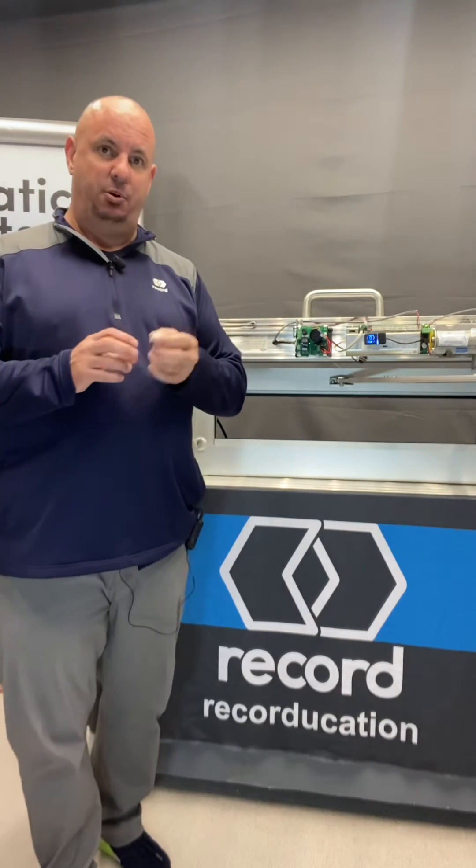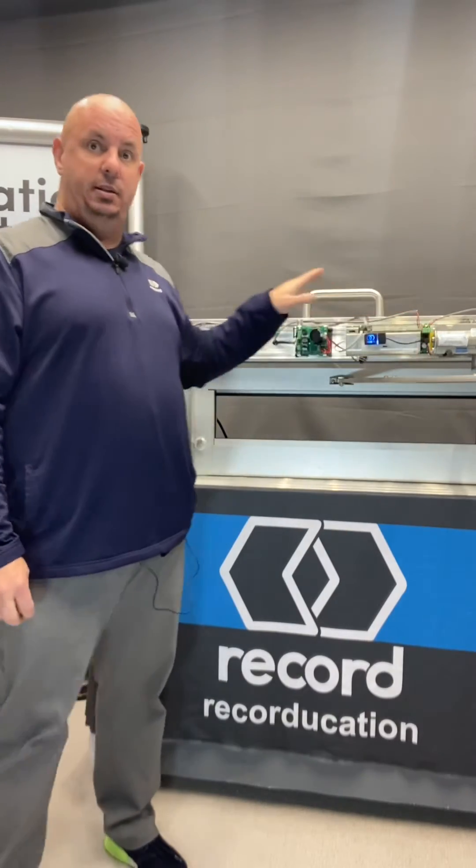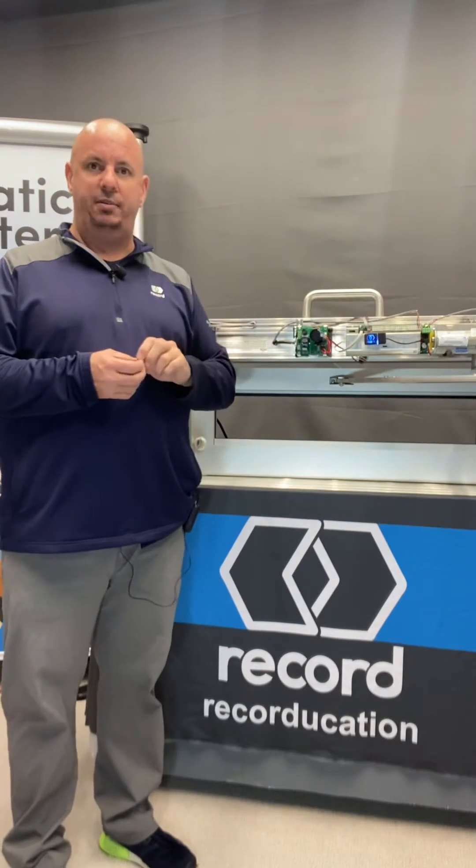So when you're wiring your sync cable between your primary or your master unit and the secondary or your slave unit, you're going to wire 25 to 25, 26 to 26, and 28 to 28.